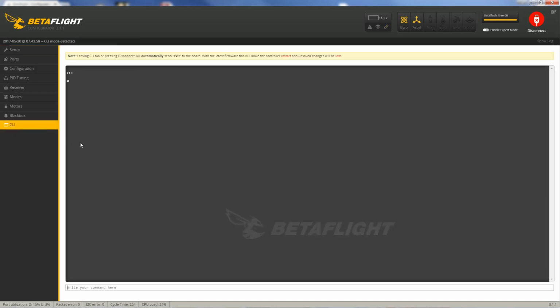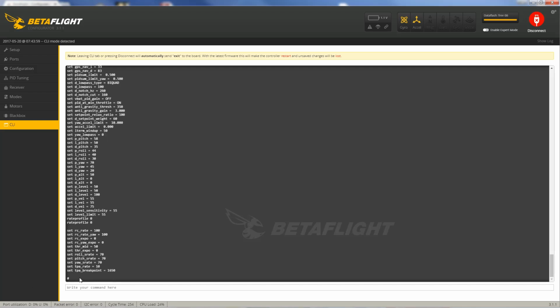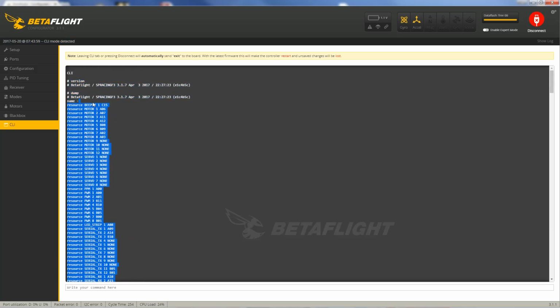One of the first things you can do is see what version you're on. Type in version there, and as I said, this is the latest version at the time of this video, 3.1.7. The other thing that's always good to do when you first start off is to type dump in the CLI command and capture all of this information, right click on it, hit copy, and paste it into Notepad or some other text editor and save that file.